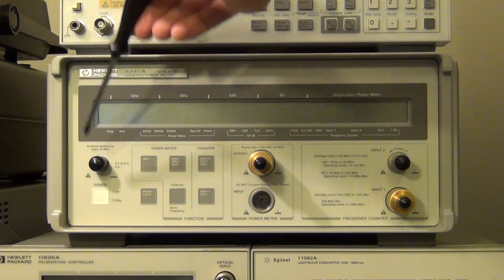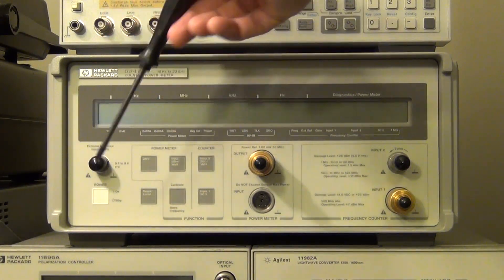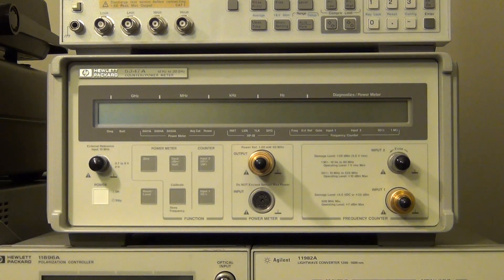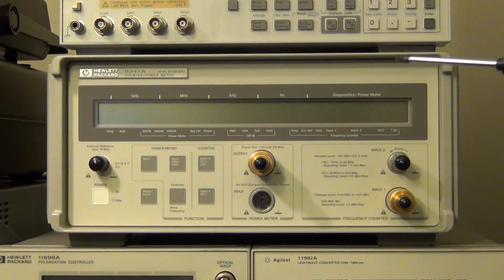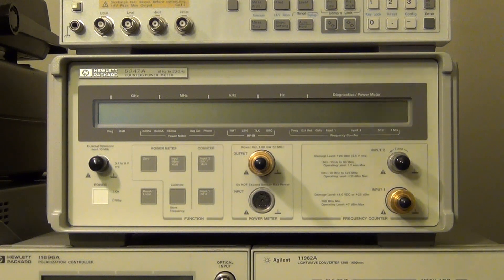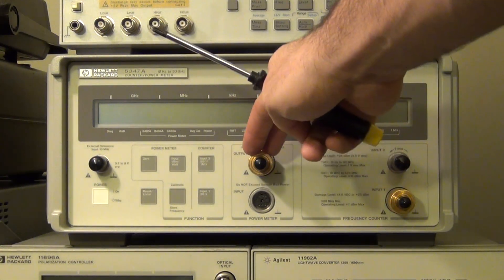This will be the reference internally. It's useful to have this in the front of the unit so you can easily access it. On such a large front panel, it's easy to put this in the front. In the middle here we have the interfaces for the power meter. So this can act like a power meter as well as a frequency counter, which is nice that they've included both together. This is a very large unit — that's the disadvantage — and it's pretty old. At the bottom is the interface to connect to a particular power sensor, and it supports a range of power sensors. At the top is the calibration output for the power sensor.